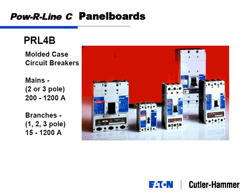And trying to get that handle, if you know the way a circuit breaker works, there's a toggle mechanism on the inside. So they kind of snap. Trying to get these handles to open and close on a circuit breaker that big, you almost always got to have an extension, put a little extension that we ship with them to open it up and down. So you got to have some strong hands.